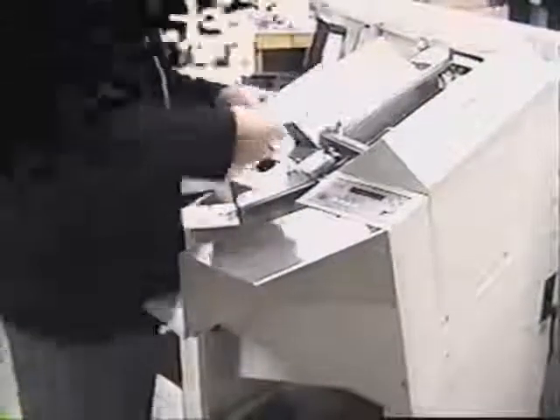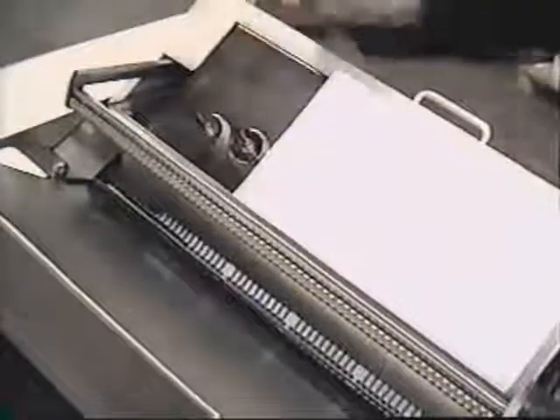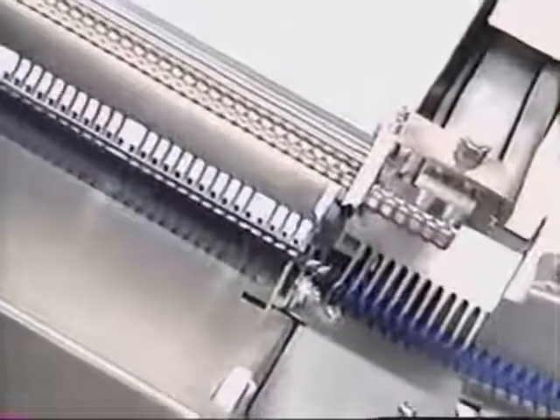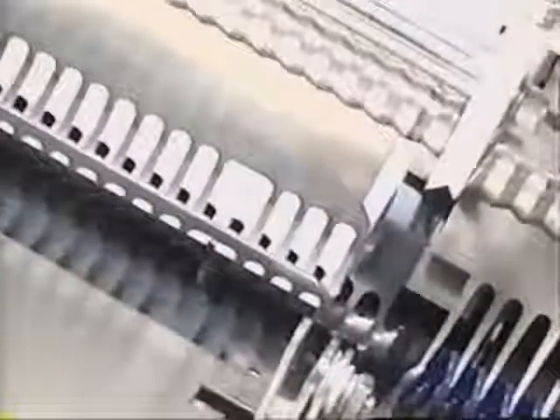Next, we will test the entire book in the digicoil. Place the book on the operator's right. Place the magnetic stopper on the edge of the book as shown — this stops the paper from skewing when the coil is inserted into the book. Next, place the appropriate coil on the coil drive. At this point, check to be sure all the holes in the paper line up. There should be no obstructions from either the platen fingers or the top coil guide.